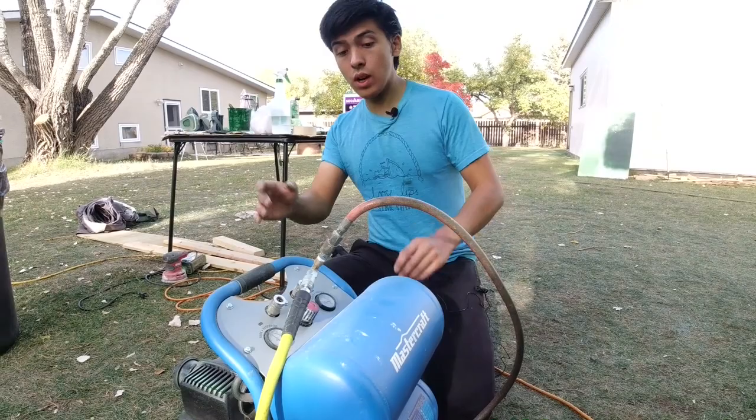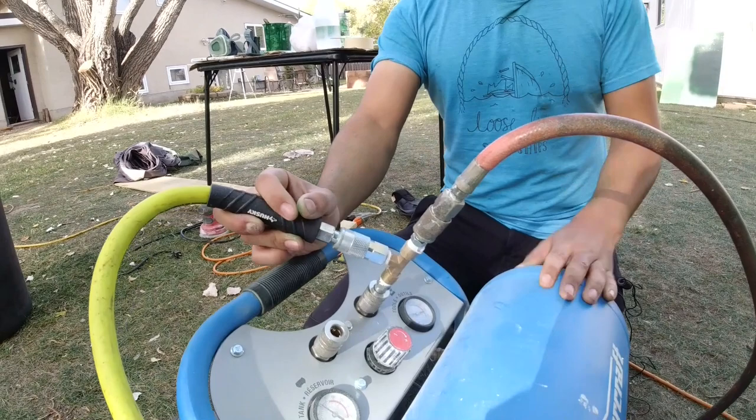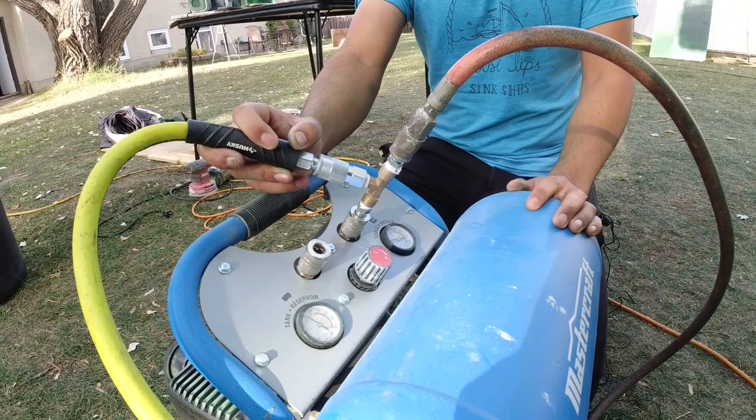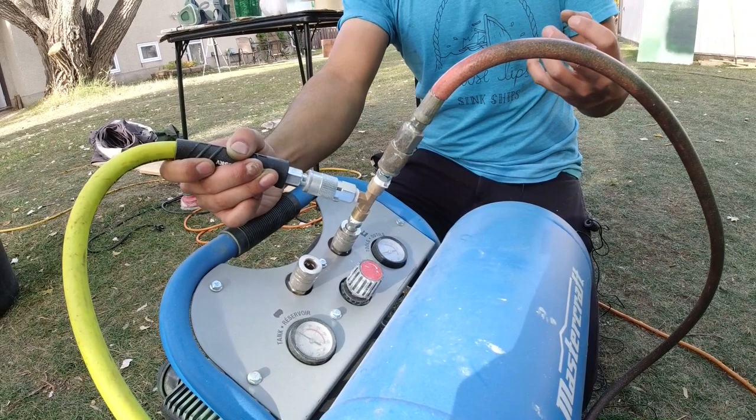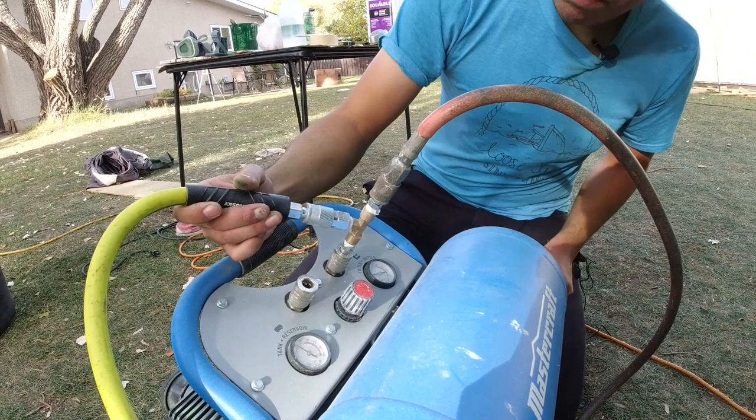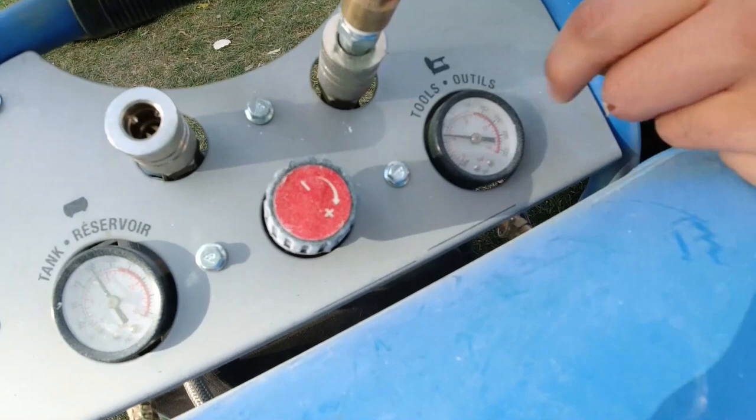And so what I came up with, you guys will be confused, what the hell are all these things? Well, I have several compressors. This is my dad's old compressor and this new one that we bought in order to have a smaller unit to do air nailing and stuff. And so we just have them teed together. So this is a line heading to the other compressor in the garage, which itself can provide about 4 CFM at 120 PSI. It's regulated down to about 60 static. It'll probably drop down to like 40 while running.